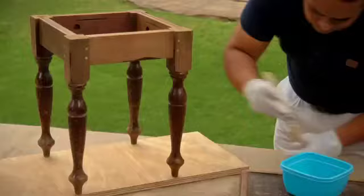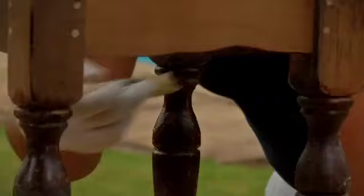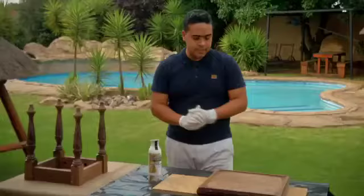So I'm going to apply a paint stripper to remove the varnish adequately. When using a paint stripper, always follow the instructions on the product packaging. Two coats ensure that the product covers all the areas where we want to revive the wood. The paint stripper is busy working, so we'll leave that for a couple more minutes.